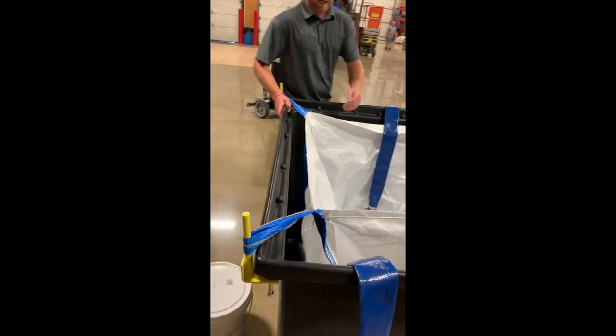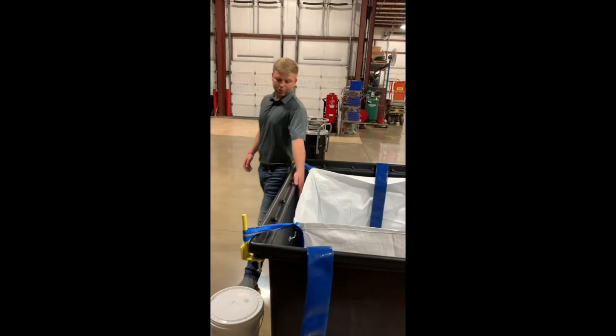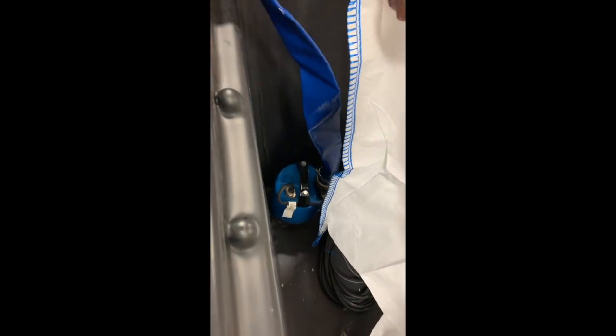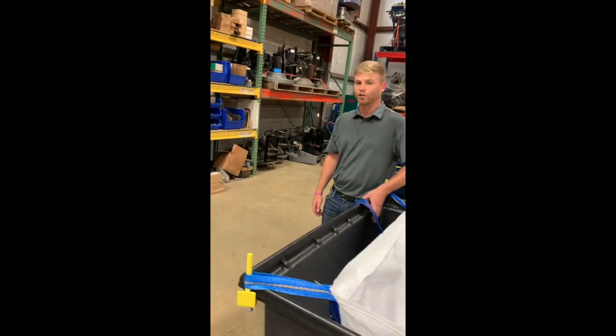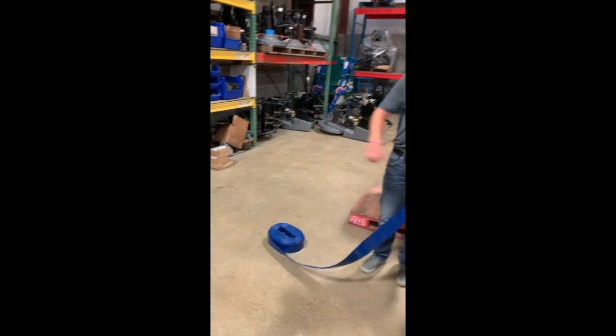Fill this bag up about three quarters full of slurry before you empty it. After this is all filled up with water, there's a pump in here — it's a dewatering pump, also 110 volt. This water that's in this container on the outside of the bag is able to be put right down any drain. So all you do is put that pump on and pump the water right out.